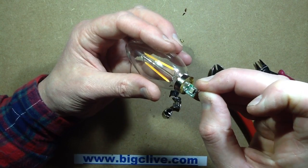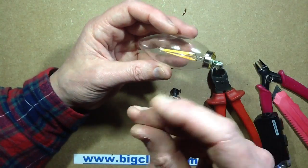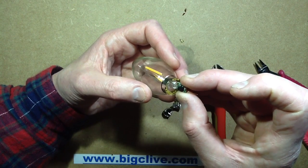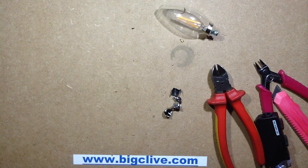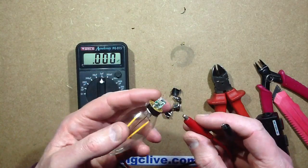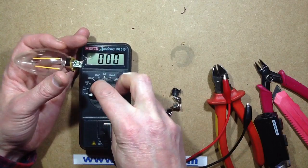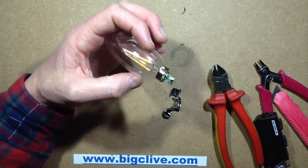You know what? That 150K resistor is probably there so the lamp actually goes off when you've turned it off at the wall — because otherwise the slight leakage of current through the switch wiring would probably make this lamp continue to glow. I'm going to whip that resistor out; I quite like the idea of lamps that glow with free power. But there is no series resistor that I can see — it really is just a capacitor. Let's check the value: 330nF. That explains why the whole thing was running cold, but it also means that when you first power it up there's going to be quite a spike of current because there's no real current limiting initially.